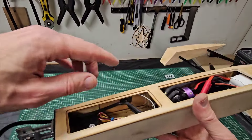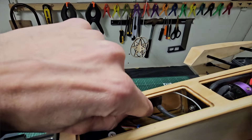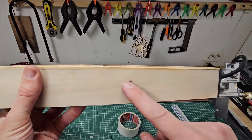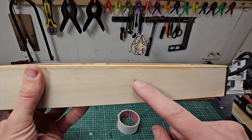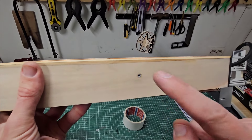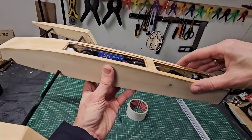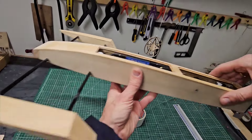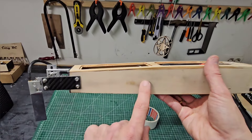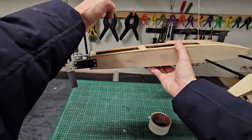Of course I showed you the motor, and the water cooling outlet is over here, on a nice piece of carbon fiber to reinforce it. It's just a small piece of 4mm, 3mm internal diameter aluminium pipe. I put it on the left of the top because normally you run these boats clockwise, and if the boat is passing you, you can see the water coming out. If you put the water cooling on the other side it's much harder to see.